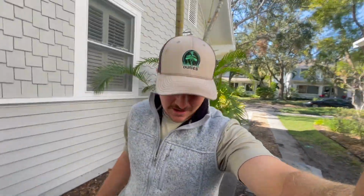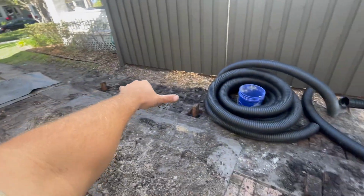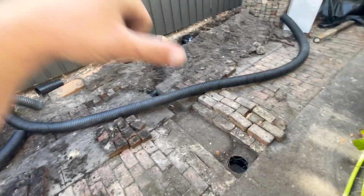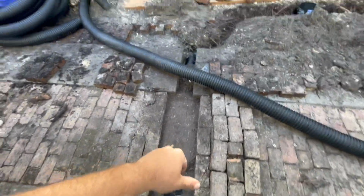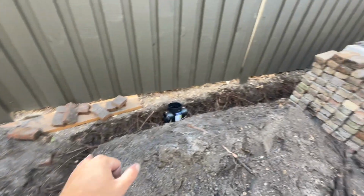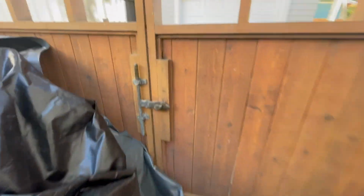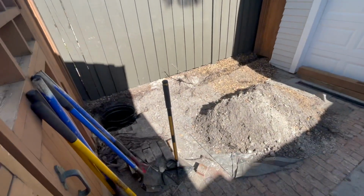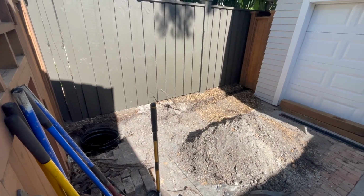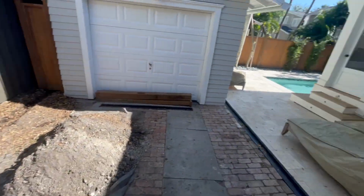All right, time is about 12:15. Made it pretty far. We got our first about 15-foot stretch, 10-foot stretch to our third basin. Coming here, we've got this basin in where it's teeing in. These will run down this line to the sump basin, which is in place. It'll go to 1.5 inch PVC out the back.